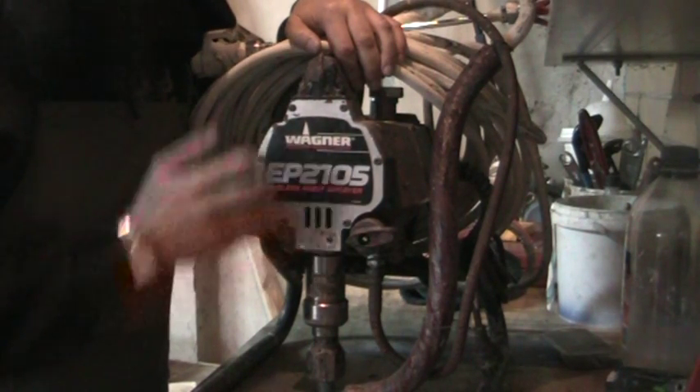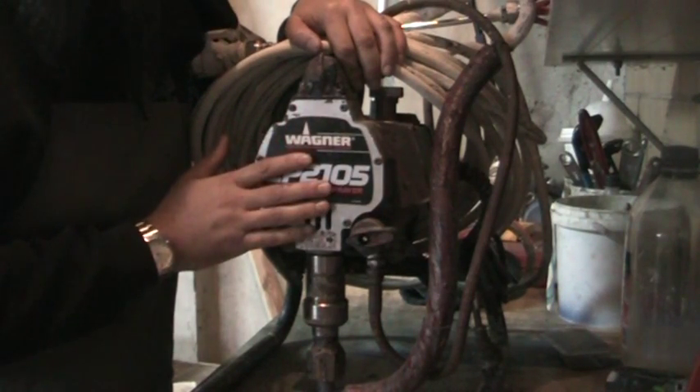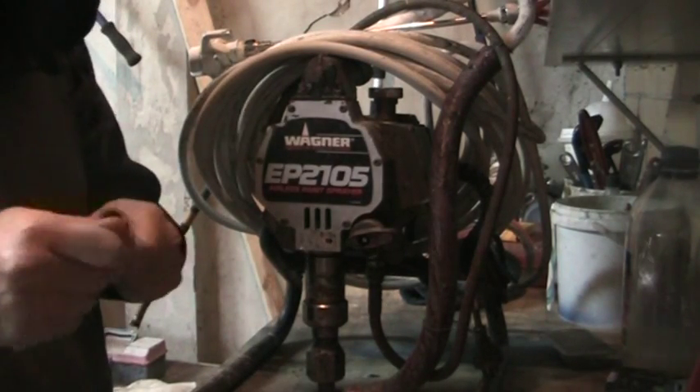At that stage you'll need to replace both your piston and your packers, but an inspection by pulling the pump apart — the technician will be able to tell you if that's the case, or if it is just a set of packers or just a piston.